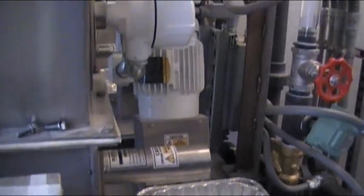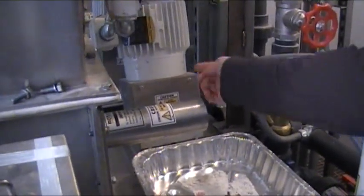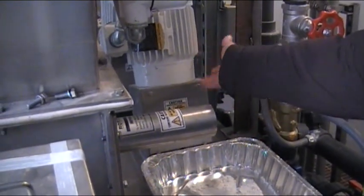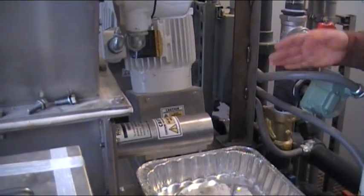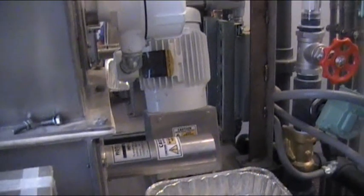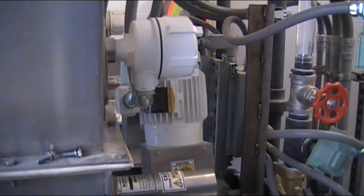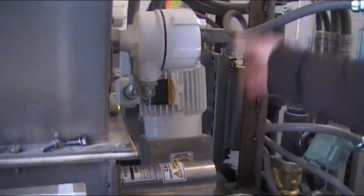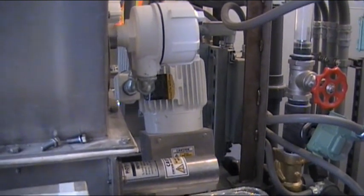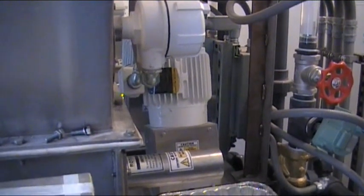You've got to pull this rack off. To get that out, this pulls off and then there are four bolts that hold the motor in. If they have to take that out, they pull that out and pull the motor out on the shaft. Ideally with the mixer, a bearing could go bad which means you pull out the whole thing. But if the motor goes bad it's just four bolts — it's a Lovejoy coupling. You do that and then pull out the motor, put a new motor in. Easier said than done from this position.